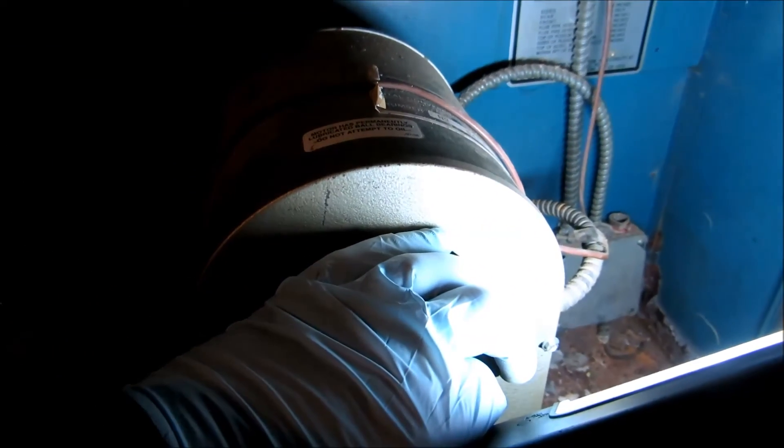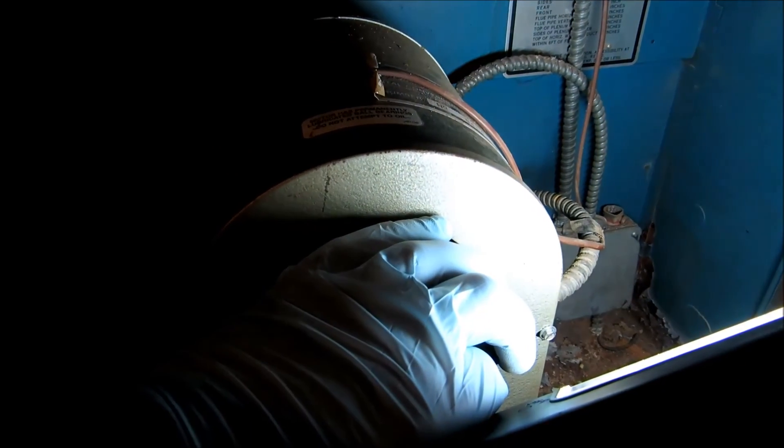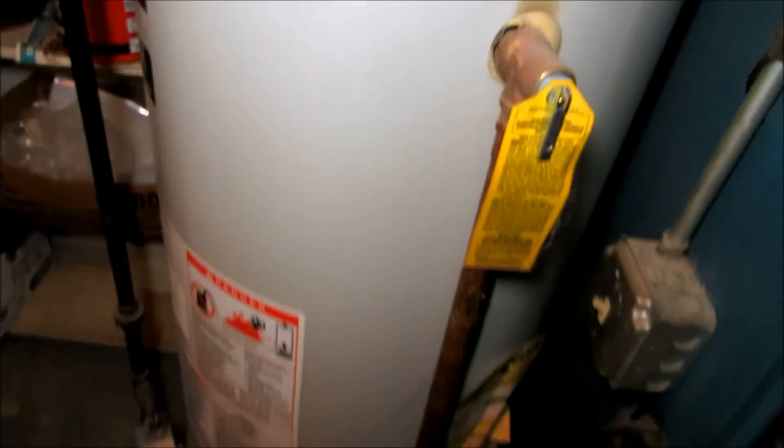It's probably out of balance — I think I'm missing some teeth on the blower wheel. I can feel it shaking like crazy. But it's not catastrophically bad — just enough to cause the noise.